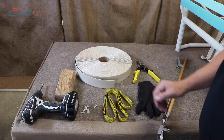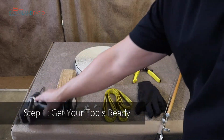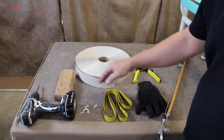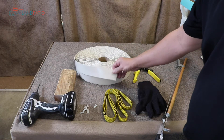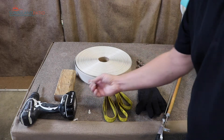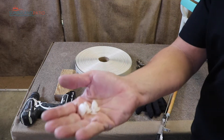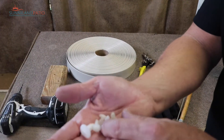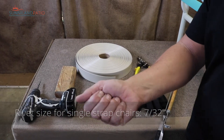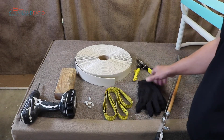For our strap project today we'll need a couple of tools. First, your drill with a quarter-inch drill bit, just a piece of wood — anything you can drill on top of to save your workbench. The replacement vinyl strapping, bought by the roll usually, or you can buy pre-cut straps which makes it a little easier. And then rivets — depending on which size you may need for your hole in your chair, we have various rivets available. A cloth measuring tape in order to get your measurements for your straps.